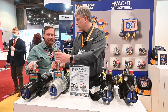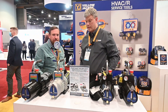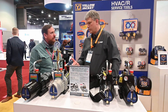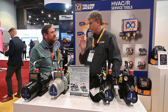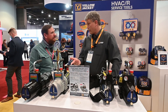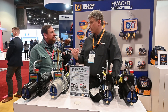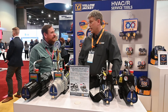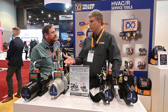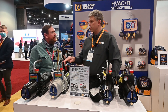So you do make this tree with the half inch. And then you have micron gauges that go with this product as well? Yes. We've got several different styles of micron gauges — from the digital style where it's basically analog movement of a digital gauge, to the analog gauge for vacuum. But then we have the new vacuum gauge from last year with our YJAC series product. So now you're able to put it all into your phone, pull that vacuum, put it in a report, do a data log on the vacuum, and see over time how it actually pulled down.